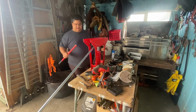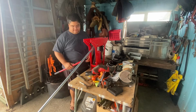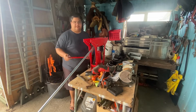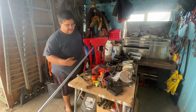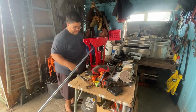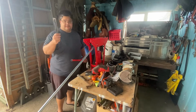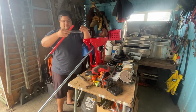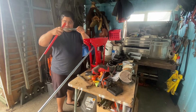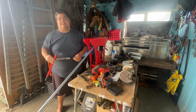And once I get it to where it looks like it's the angle, a little trick that I learned. It's nothing technical. You don't need no fancy device to measure angle. You can get two pieces of pipe, a pin, a bar. In this case, I'll use an old Sawzall blade and the handle from the jack. And what I'll do is I'll just put it on top of the pipe, copy the angle, take it to the other side, check if it's the same.